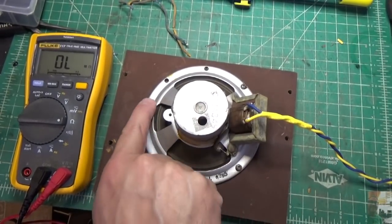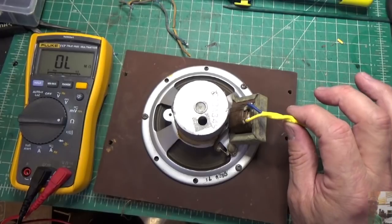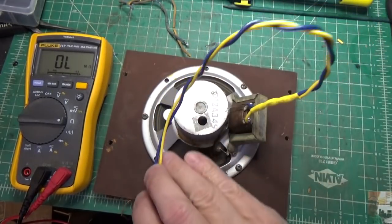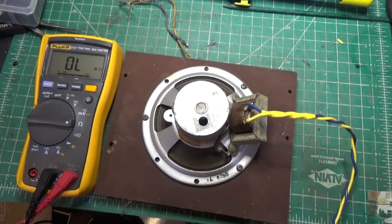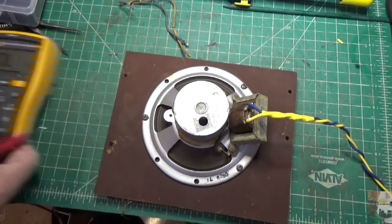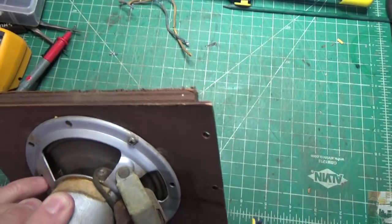Starting off with the speaker — I've cleaned it with 90% alcohol, paying special attention not to wipe off the markings on the speaker since the alcohol would cut through that. I've cleaned it, blown it out, and replaced the wires. When I replace wires on something like this, I always like to put a piece of heat shrink tube around here as a strain relief so they don't pull apart. Now we want to check for continuity — putting a meter on each lead: 1.2k ohms, that's exactly what we need on the speaker.